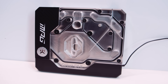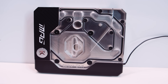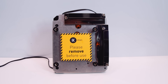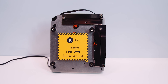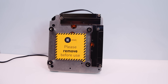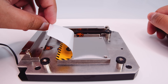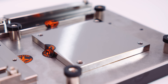There's also a carbon EKX engraving on the other side of the monoblock. Looking at the micro fins and jet plate, the quality from EK is amazing as per usual. You can see O-rings that seal everything to make it watertight. Flipping the monoblock over, the cold plate for the CPU IHS contact is covered with a label, and you can also see the cold plates for the VRMs and chokes, along with included thermal pads.